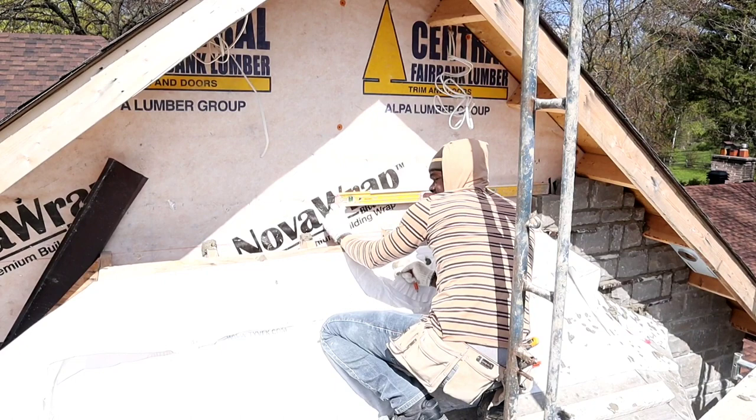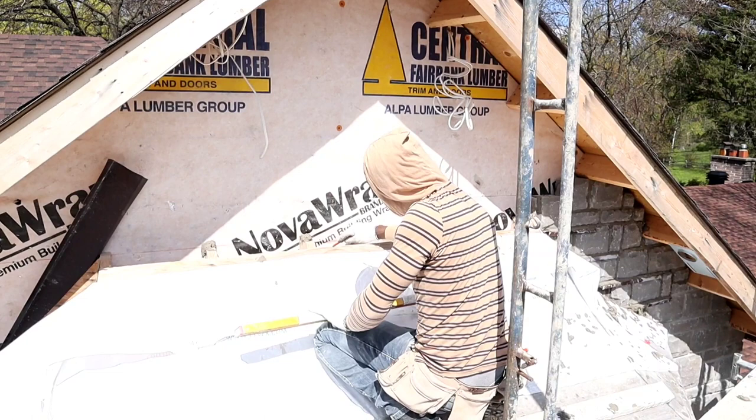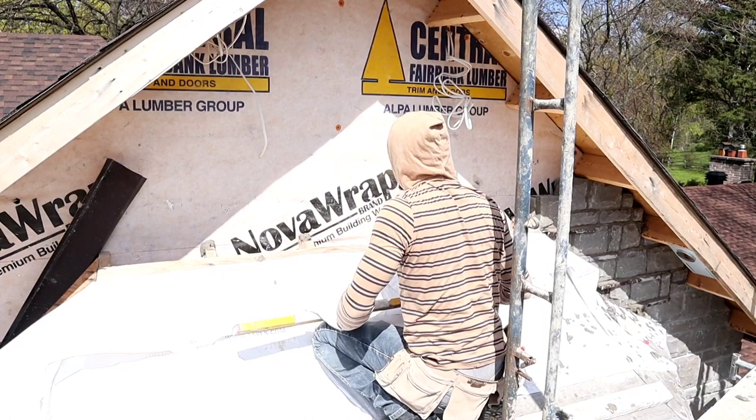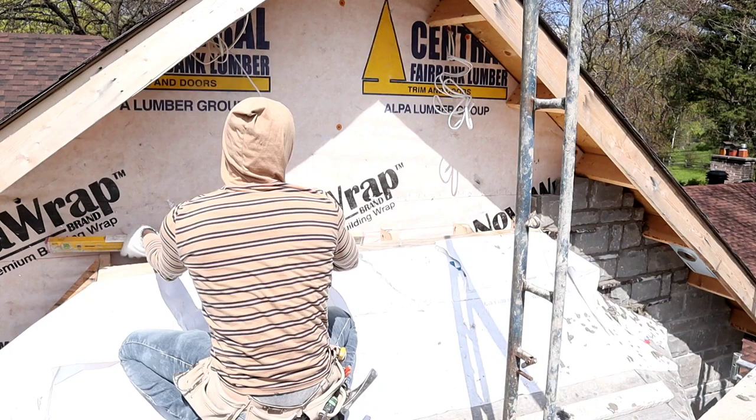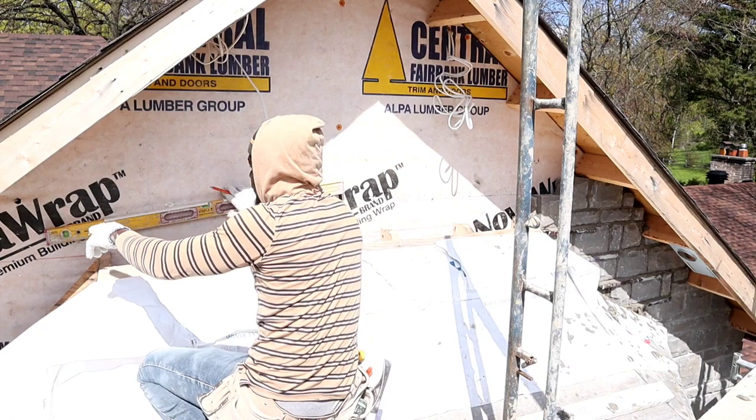So guys, the reason why I'm catching my level here is because I wanna have a full stone here. So I wanna take the measurement from here down, which is 6.5, and then I put the cut down here just in case I have to put a piece of cut down. So that's the reason why I'm catching my level. And another purpose is to try to have the same joint from that side over there, over here. So after, we're gonna take our measurement down the 10 inches to work our way up to have the same joint. I explain more when I get here, guys.